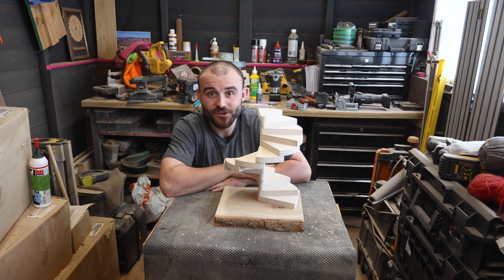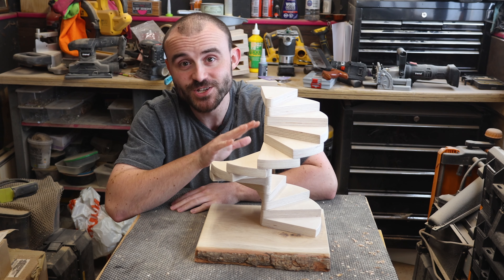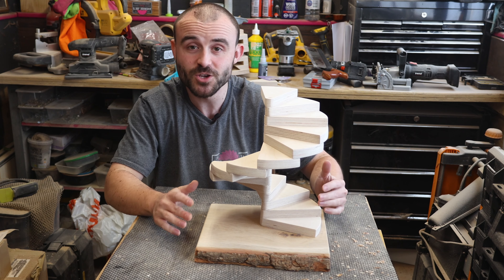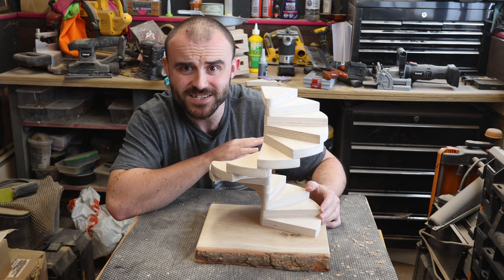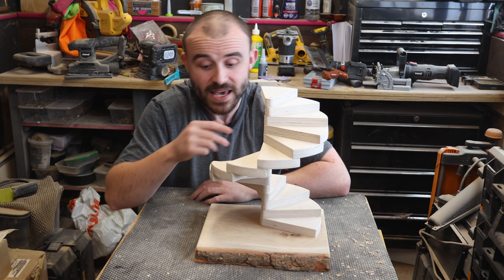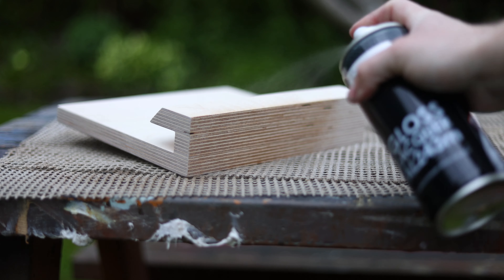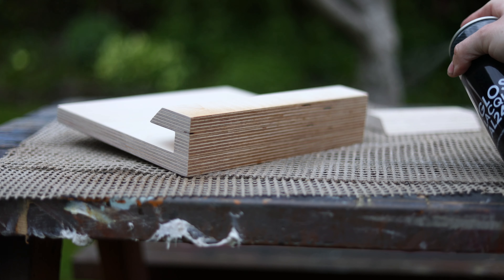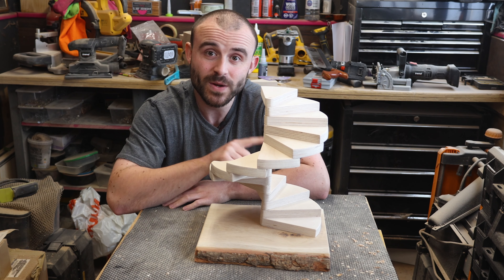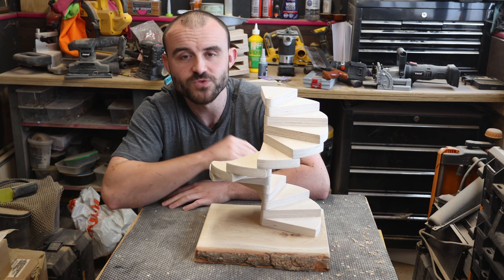Normally I'd take this a step further and apply a finish, sanding between coats. But the friend I'm making it for wants to do the finishing herself. So on my part it's done — sanded to 240 grit and dusted. She can go ahead and stain it or add some wax. If I were applying finish, I'd probably opt for a spray lacquer on this one: quick to apply, easy because of all the intricate pieces, and easy to sand back. I'd probably do three coats, sanding between each, to bring out the grain and show some really nice contrast in the colors.